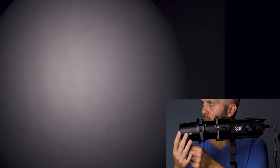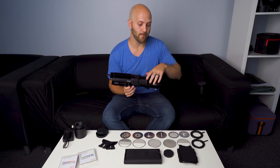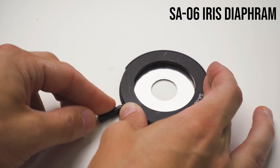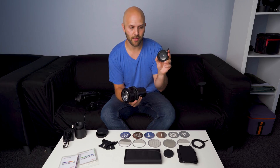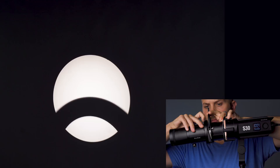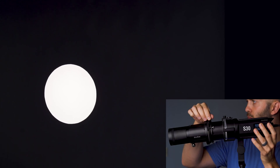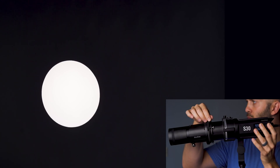But wait, there's more. Each of these pieces is going to affect the LED in a different way. First, we have the iris control, which is essentially just aperture blades. The projection kit has a little area for you to sandwich pieces on the inside of it, and this is where the iris control goes to control the aperture of the lens. That allows you to narrow or widen the beam of light. By far, this one gives you the most significant level of control — you can take it anywhere from the widest potential of the lens all the way to a tiny dot.